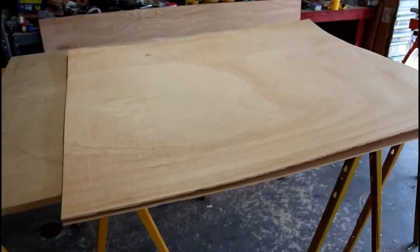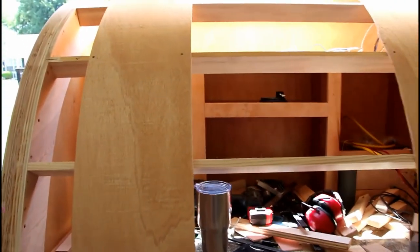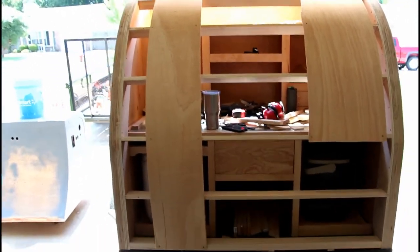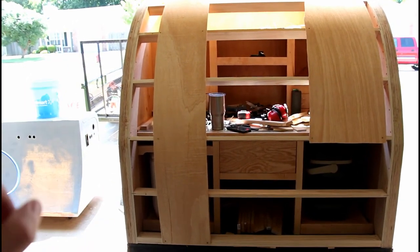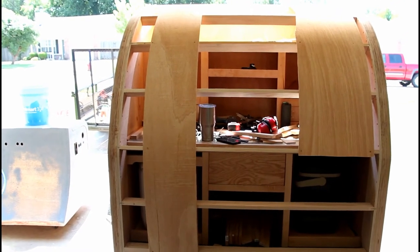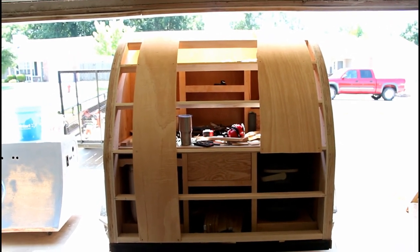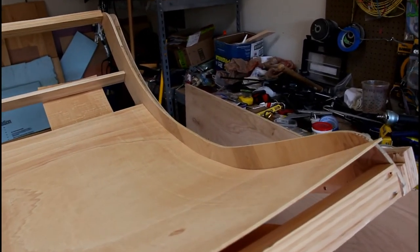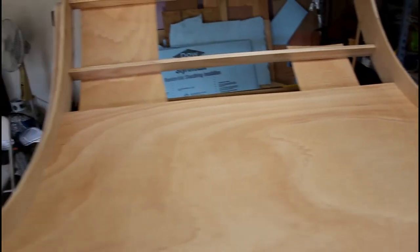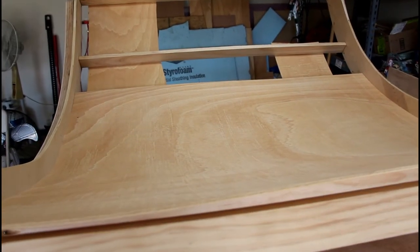I have the interior side of the galley hatch cut down. Before I take it off to start installing it, I've put some pieces of board on here to keep the hatch from wanting to torque — even an eighth-inch off is quite a bit on this. I threw the first piece in there to see what the edges look like. If both pieces fit fine, I'm going to take it out, sand it, and then spar varnish it.